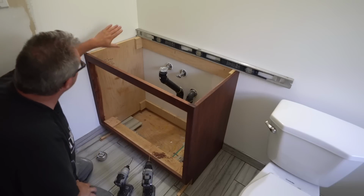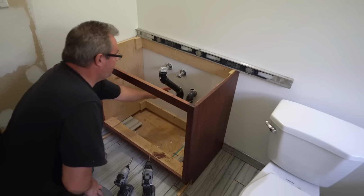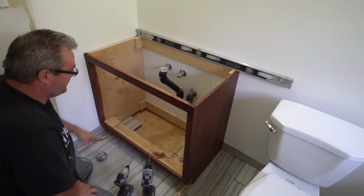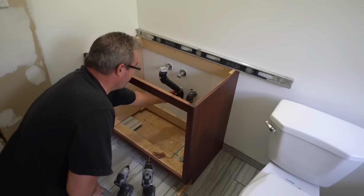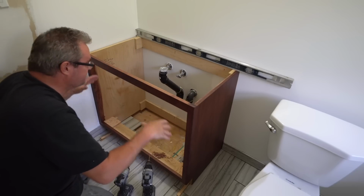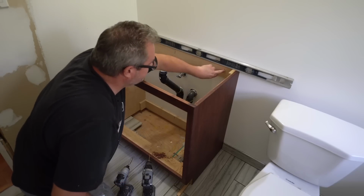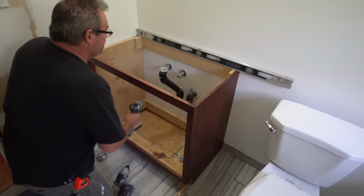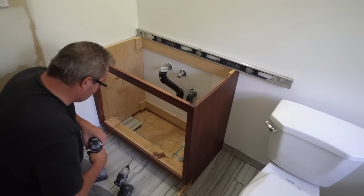It's a couple of days later and I've painted the walls around the vanity, and I've also fixed up the plumbing here, the drain line, so that it lines up with the sink that I have. I actually made a video on that, and there's a link in the description to that if you want to go watch that. I've put the vanity back in place and lined it all up, made sure it's level. I've also made marks on here where the screws go. I'm going to put three screws in, two at the top up here and one down at the bottom. And that's basically all I need to hold it in.